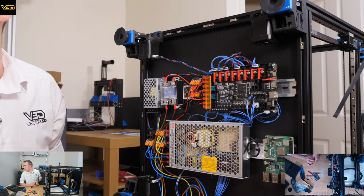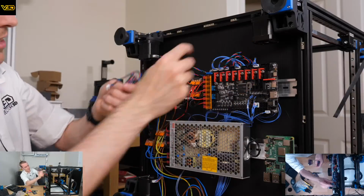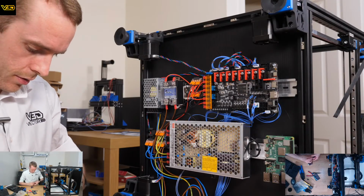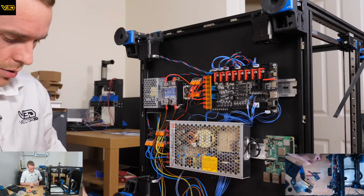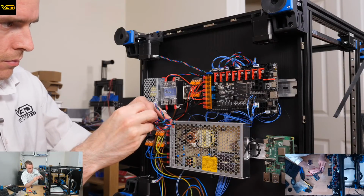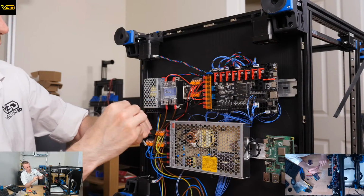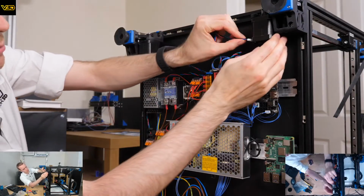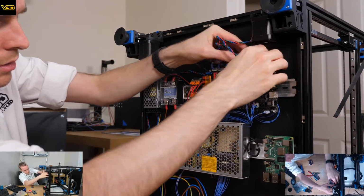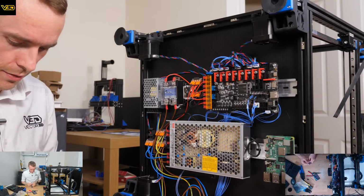This one is super duper short, so this is going to be the front right, and that's going here. Yes, so that's literally 3 centimeters. So zip tie that one before it even gets on there. In fact, could we do... No, I think that's going to be best. So just a bundle with the two terminal connectors sticking out. So we've got the 6-pin going into the motor and the 4-pin going into the control board. Oh, come on. Like so. And tidy, yeah. I feel like it's going to cause problems having all of these cables bundled up against each other.